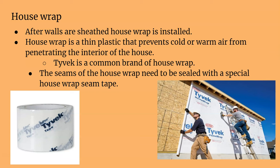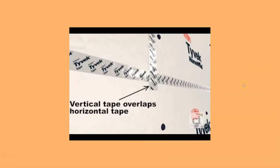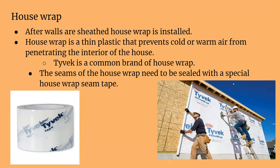House wrap is semi-waterproof but I wouldn't call it foolproof waterproofing — it's more of a protective barrier. It does help before you have your finished siding or brick on. It prevents air more than water, but it does prevent some water. Any time you have seams you need to put Tyvek tape — house wrap tape — and tape all your seams up, otherwise it won't work that well.